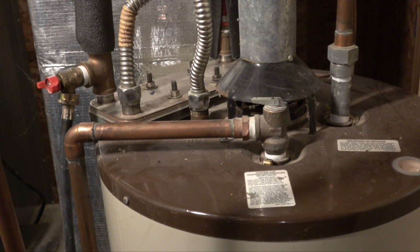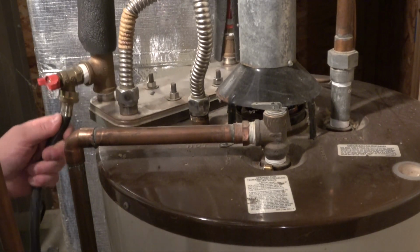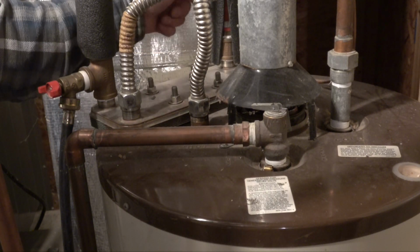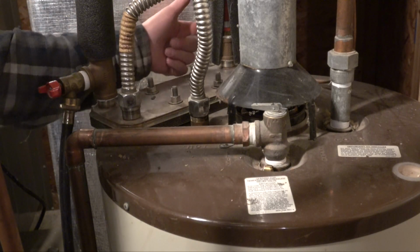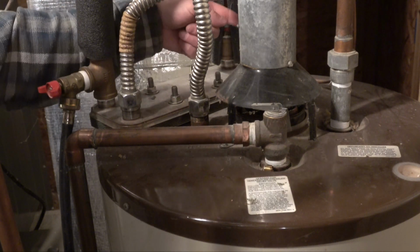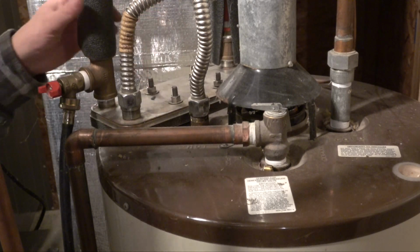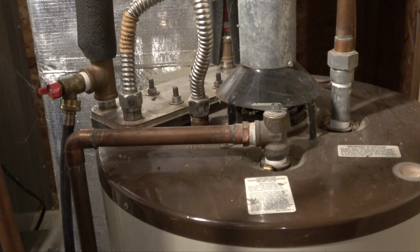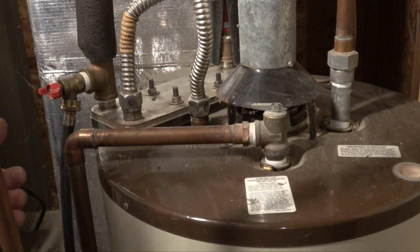We'll see. So this is the hot water heat exchanger, and if you notice, it's just sitting on top of the hot water heater because the water is coming in through here. Then you've got these right here circulating with the boiler. Then you have these circulating in line to the water heater. So it's just a little thin plate that it keeps hot. You can feel it, it's very hot. And it runs through there, and it basically heats up the hot water.